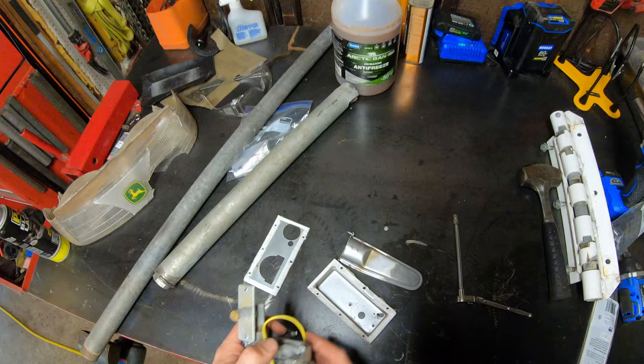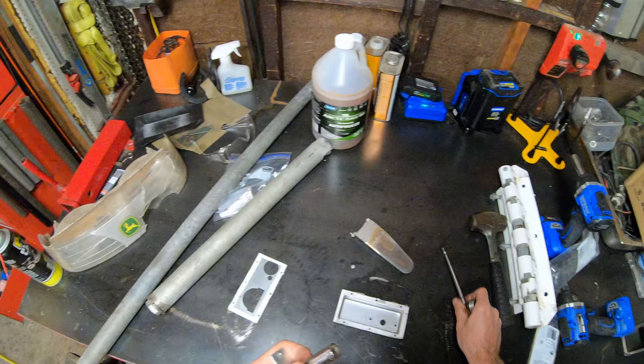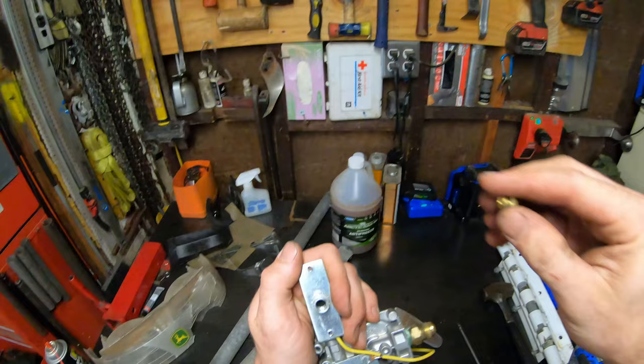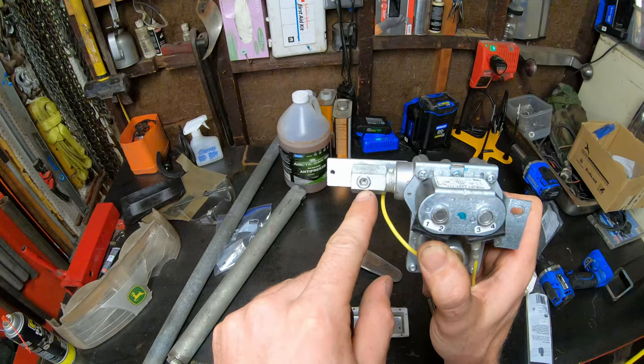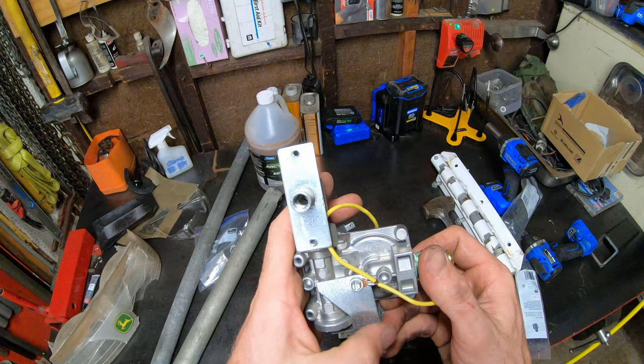There is the orifice and it looks clean — unfortunately I don't like the sight of that. I'm not sure where this thing isn't lighting up now. That's leading me to believe that maybe it's actually just one of those sensors not detecting the flame. I'll take this orifice out anyway to make sure there's nothing behind it blocking the path of travel. This thing looks clean and tidy. I did originally try to take this hex off but it would not budge and was just going to strip. Everything's seeming pretty good here.